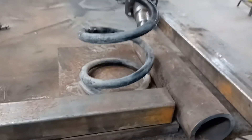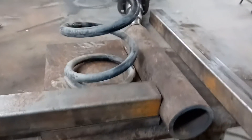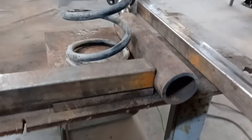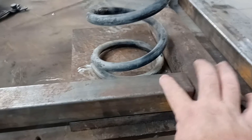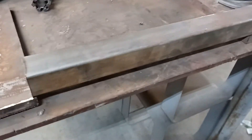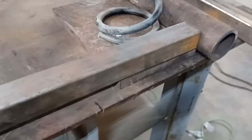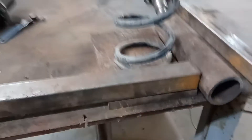This tube is going to be fitted so it will slide up in there better, and it will be welded perpendicular with the round tube. After I get that done, I'm going to gusset it from here to here just to give it a little extra strength. Some trailers have this arm fairly short, and one guy really didn't like that because it creates more of a steep angle with your spring setup. Mine is 24 inches long on this one.